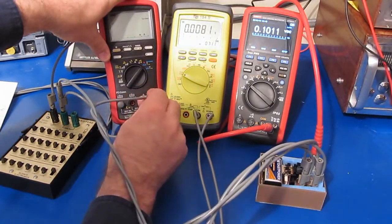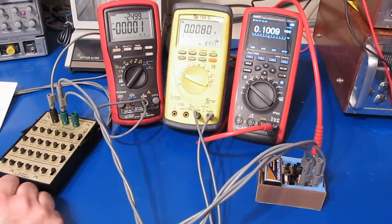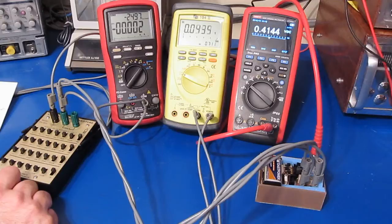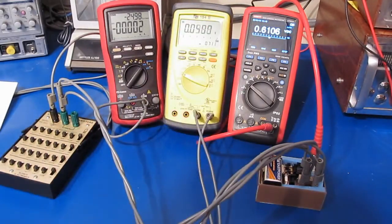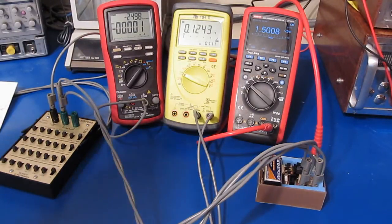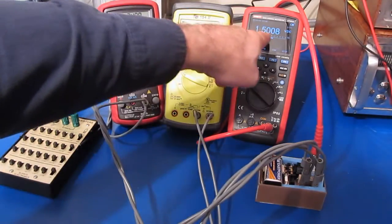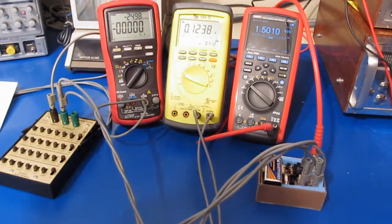Removing the Brymen meter and increasing the current: at roughly 600 milliamps we are now dropping about 50 millivolts. At roughly one and a half amps being applied, we are now dropping 123 millivolts.